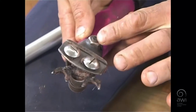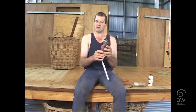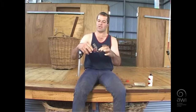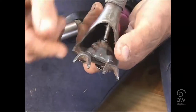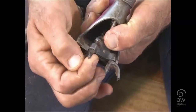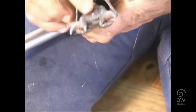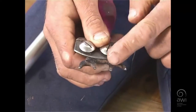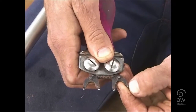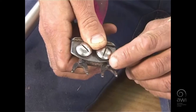On this side, we've got the post, and that sits inside a cup. The cup sits inside what we call the yoke — that's this main bit here without these attachments. Up the front of that fork yoke is a set of chicken feet. On the back of the chicken feet, we've got two sets of pins — you can see them on both sides there. Those are pins that fit into the front of the cutter, and these are your safety pins.